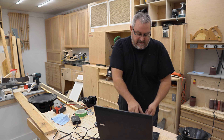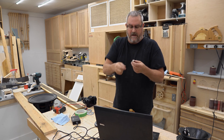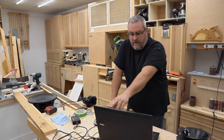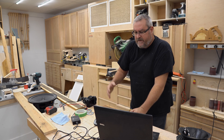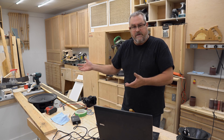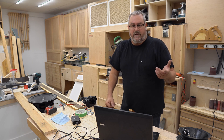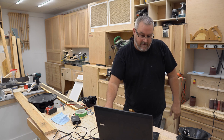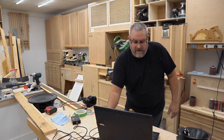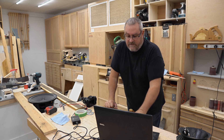The same thing applies for measuring the VAS, except you use smaller weights. I have two that are 47 grams each — these are just pieces of square steel that I cut. Plus the magnet, of course. I've got the weight entered, which is 101 grams. I've got the piston diameter — which is the size of the cone plus half of the surround — and that's 254 millimeters. I do all speaker stuff in metric because that's how I was doing it before. So I'm going to press the Measure VAS button again, and hopefully that's enough weight. And it is — we've got a number. The VAS on this one is 142.8 liters.